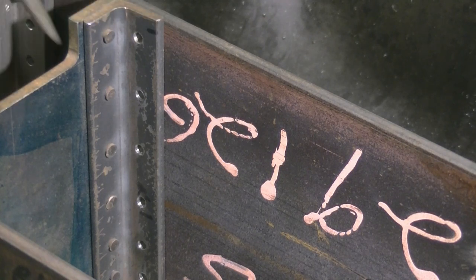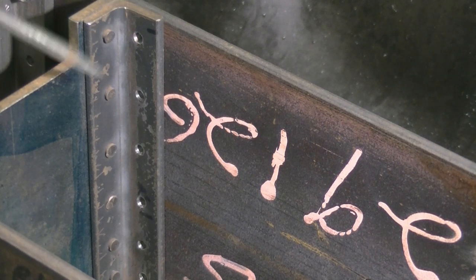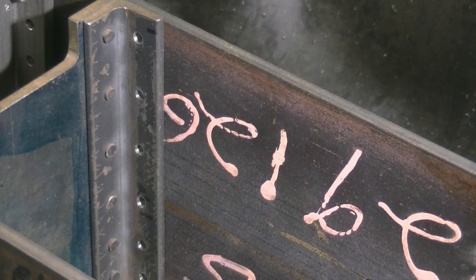So off with the rivet tails, make up a new angle plate, correct these holes. I'll clamp it all up with a big clamp over the outside, and then I'll go through and mark the holes with a bit more accuracy. Disappointing for it to come out like this. I didn't expect it, but I have a suspicion that the piece of steel plate that I used on the build table was not dead flat. That might have kicked the frames up. My fault. Can't find any other excuses. I just didn't check that it was square enough. Greenhorn at it, I suppose. We'll come back tomorrow and see a bit more work.